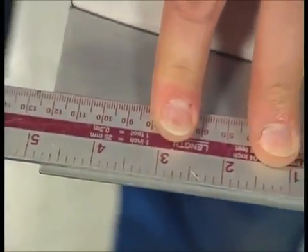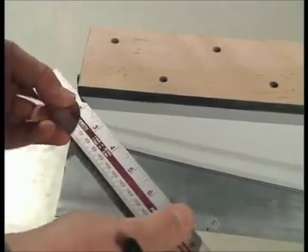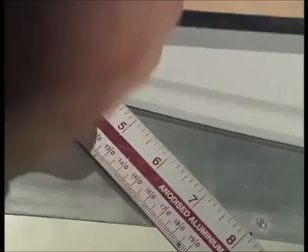The next job is to remove part of the trailing edge at the root end of each blade. I've got to come in four and three-quarter inches from the root end along the trailing edge, and then up the root end four and three-eighths inches, which actually takes me to the edge of the wooden block. Join up the two marks, scribe it out — there we go. Then it's a matter of hacking it off, so you need a hacksaw, Pete. Yes, hacksaw — quick, go, thank you very much.